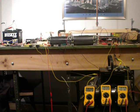However, when it's in position two, there's still some power left in that capacitor which helps drive the motor as well. So the motor is actually getting continually powered but is getting pulsed with strong voltage pulses twice per revolution. And this is what helps me keep up momentum at good speeds and helps me get very good voltage production.